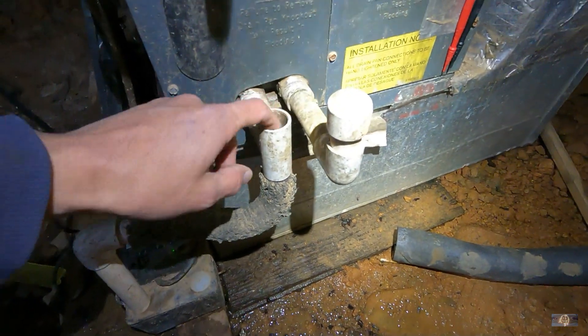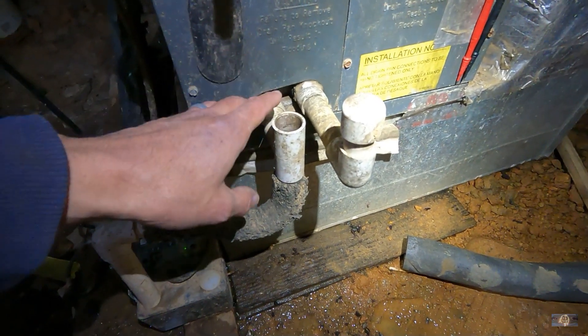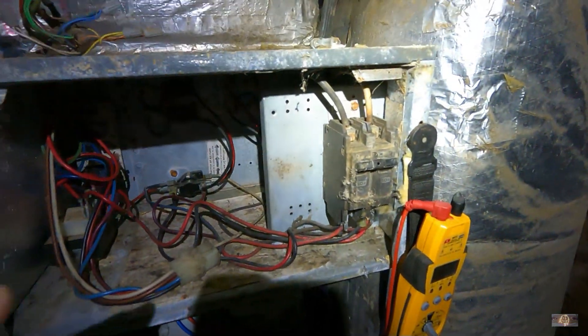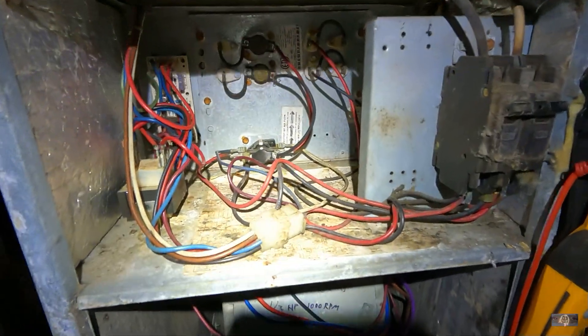This should have a little insert in it with the cap — it's a clean-out. So right now, when this unit runs, it's going to suck unfiltered air into the coil cabinet. I just opened this thing up and I'm going to see if we've got high voltage first, and then we'll see if we have any low voltage.